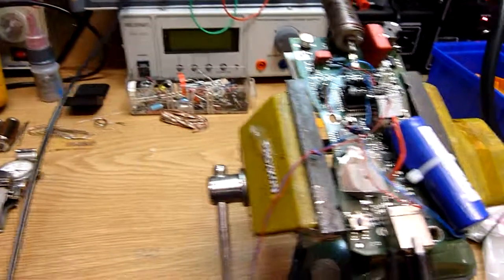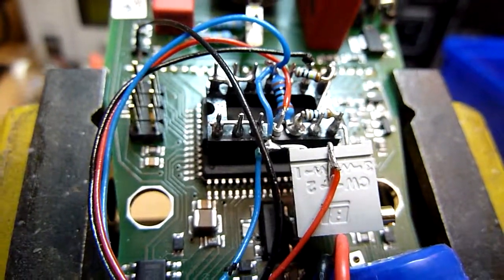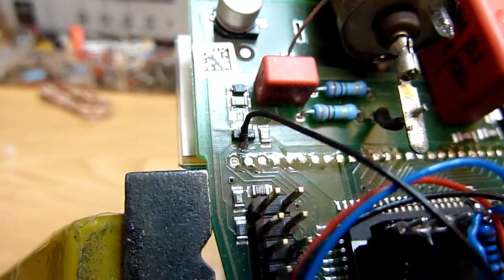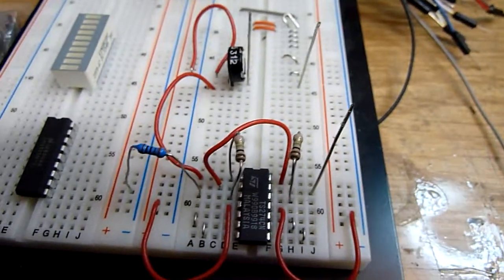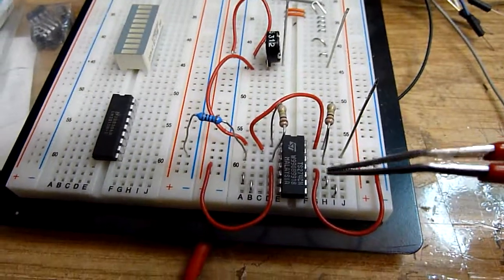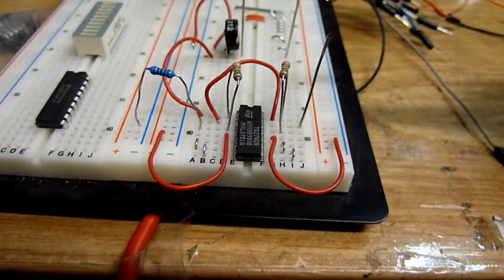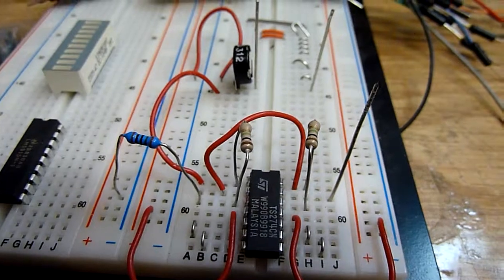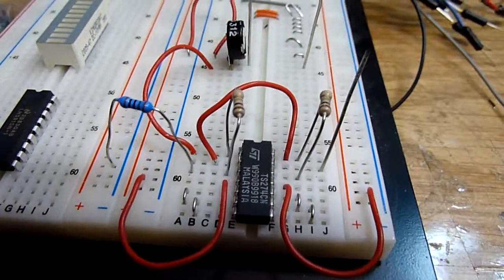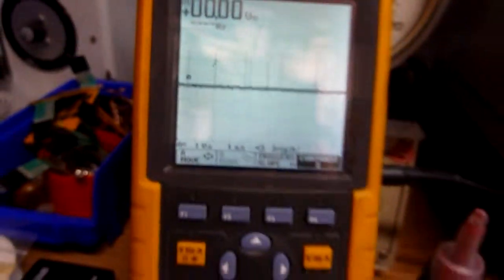When you now look at the circuitry that I built, it is an operational amplifier which is connected to the pulsing transistor, where the microprocessor is also counting the pulses from. The circuitry shown here consists of a quad operational amplifier. There are 4 operational amplifiers in this chip, and 2 of them I used, 2 of them I shorted to not get distortion and so on. I used them as an amplifying first stage, and a signal inverting stage so that you have positive pulses, as you see here, and not negative pulses as they come in from the counter tube.